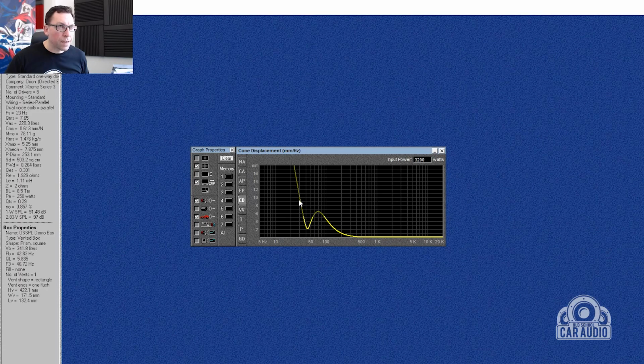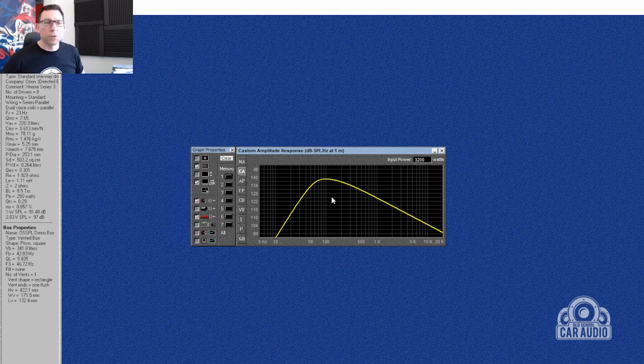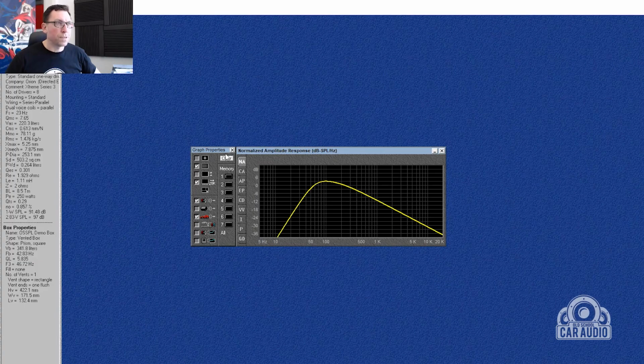And then at 40, 30, 30 hertz and below, it's going to be tuned pretty high, but they're only small subs. That suits me. If I had an Image Dynamics sub or something with a large excursion, I'd be tuning it down here at 30 hertz or 25 hertz or something and really trying to get a low frequency peak. That I'm happy with for this purpose.